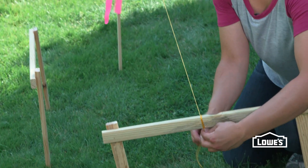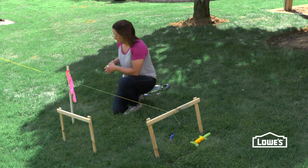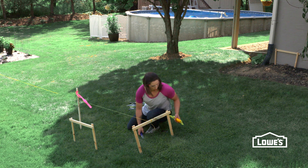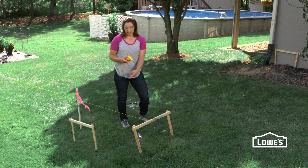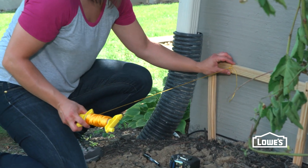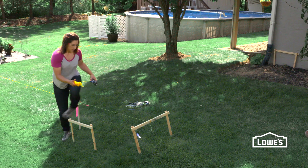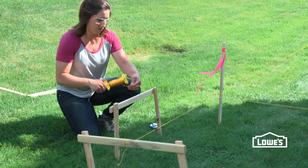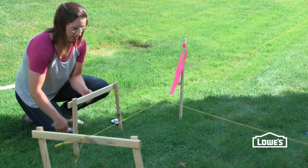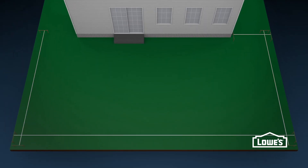And if I need to, I can move it around after I measure. Just take your tape — six inches. Now I'm going to pull the other string from that side to this batter board, give it a little knot, and kind of adjust it so it's close to your line. You can go back and do some fine-tuning later. I'm going to give a little slack here, cut off the excess and tie it tight. Continue running the strings around the whole fence layout.